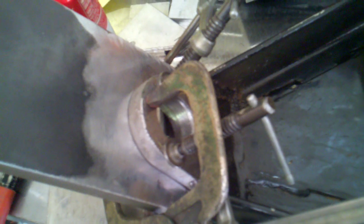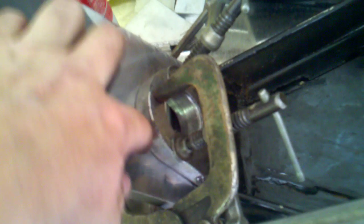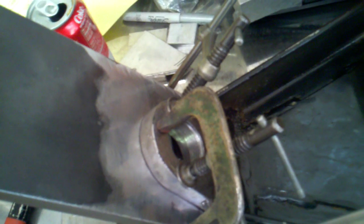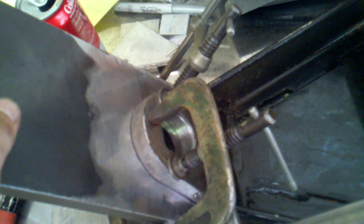So I said to myself, let me weld this piece temporarily to this machined plate. This machined plate has a hole bored in it, as you can see, and everything's pretty much square here. Once I weld it, I'll clamp this in the vise, set it back up, machine that hole out, and turn the bushing up. Stay tuned — hopefully the next part will be all machined and welded in.